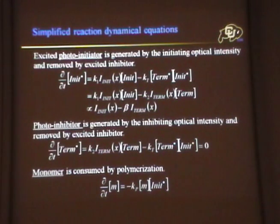It turns out it's double patterning, what they use in lithography. So I lay down one pattern, and then I add another pattern, and I try to get above the threshold just where I added one. This gives me a subtractive response. It's the pattern in one color minus the pattern in another color.